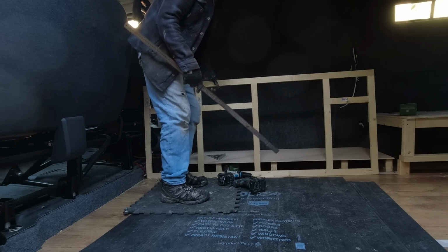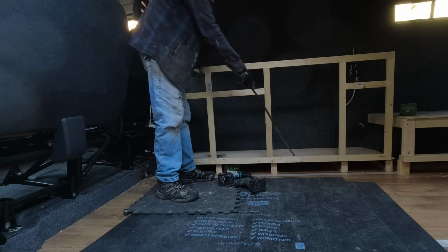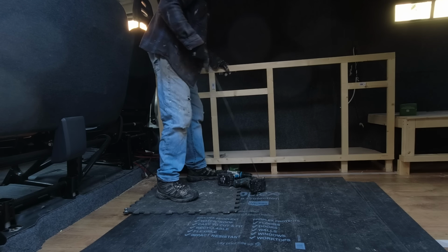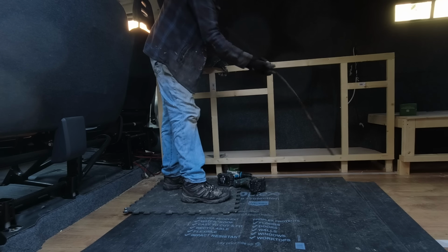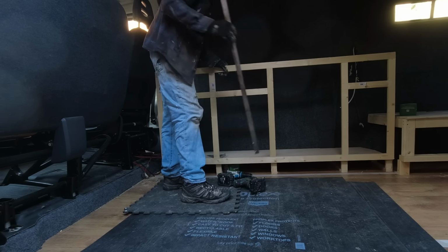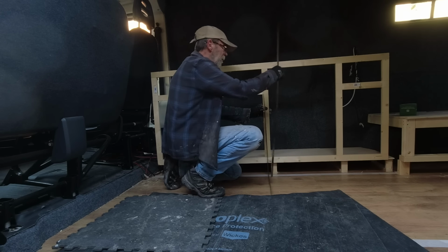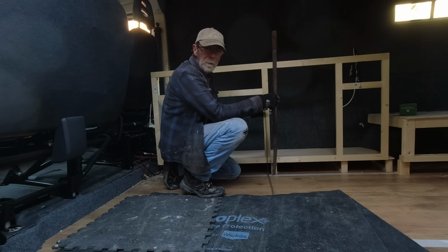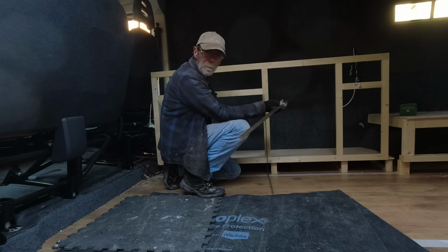Okay, so having got the legs in, I've put the 9mm bottom on there as well, and I want to place this frame on there, and then I want an accurate measurement from the floor to the top of this frame. And the other important thing is to make sure that this is square with the floor. So I'm just going to move these covers, get the square on there, and then take an accurate measurement of it. There it is. So this is sitting on the rebate that we did earlier, and now we can get a measurement from the floor to the top of there, and that is indeed 84 centimeters. So now we can take all this back out, measure 84 centimeters up the wall, and that's where the back batten will go.